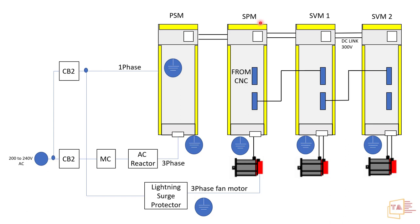The next module is the SPM — Spindle Module, also called Spindle Amplifier. In any CNC machine there is typically one spindle, though twin spindle configurations exist. The spindle may be stationary or rotating depending on the machine. To operate the spindle we need constant power — different from servo — and spindles can run at speeds like 500 RPM, 5000 RPM, or even 20,000 RPM. The spindle motor is specially designed for spindle purposes and cannot be interchanged with a servo module.